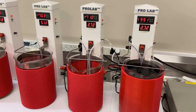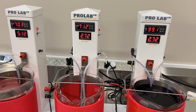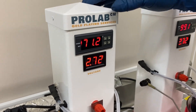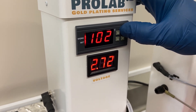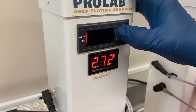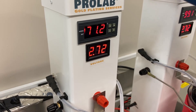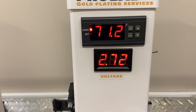This bright nickel shows 71 degrees — how do I adjust the temperature? The bright nickel actually works best if you've got good temperature control at 140 degrees. The way we'll do that is we'll push the set button — now we're at 100, we'll just walk it up — press the set button again, boom. And if you ever want to know what temperature your tower is set at, just press the set button and it'll tell you; while it's flashing, hit it again and you're set.